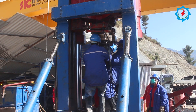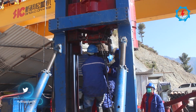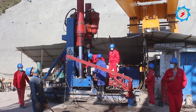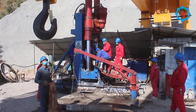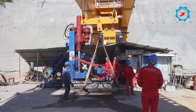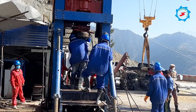The upper chamber shall be excavated up to 25 meters diameter after concrete lining, then the shaft excavation will follow. An overhead crane has been installed for lifting and lowering machinery and manpower. The 30 meter wide span gantry crane has a 16 ton lifting capacity.